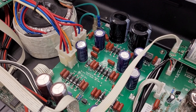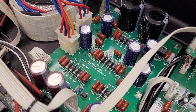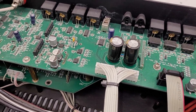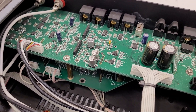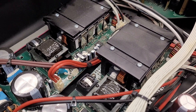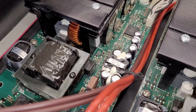Just take a look at this thing - there's the power supply board. Look at all the rectifiers and filter caps, and a nice toroidal transformer back there. There's the input board with a bunch of surface mount caps, which I don't like, but maybe it'll be okay. Take a look at the power amplifier boards right here - those look like class D digital amplifiers.